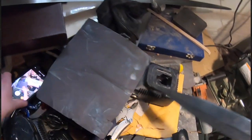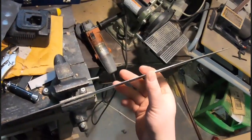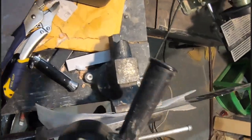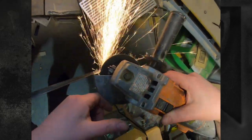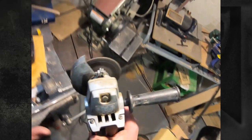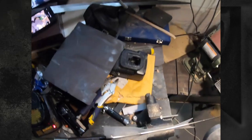When you have a larger blade like a sword — and these tend to be carbon steel, which is a little softer — this one wasn't actually sharp to begin with but has some dings in it, so I'm going to treat it the same way. Put it in my vise, somewhat padded, edge sticking up, and I'm just going to give it a nice long pass with my angle grinder to help clean this edge up. I'm using the edge of the guide pressed up against the blade to help me keep a nice straight even line without putting scratches on the flat of the blade. Nice long passes is ideally what we want.